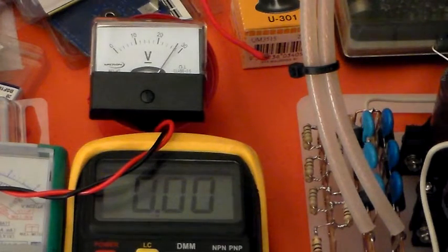If you remember yesterday, I said there was a 6 volt drop across those resistors, so it's not going to be much of a difference whether they're in or out with regard to the actual HT rail voltage. But the problem arises when the power supply is loaded up. They just can't be in circuit under those circumstances. Right.